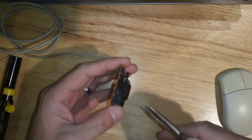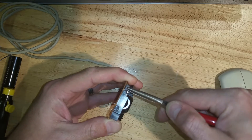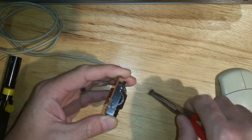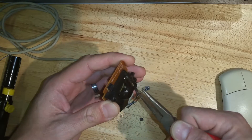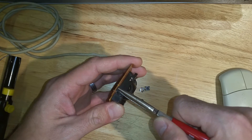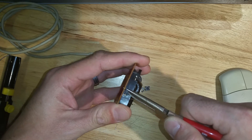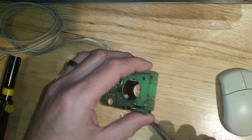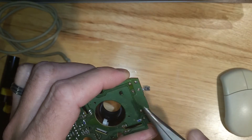Not using excessive force — just a gentle wiggle and pull that out. You don't want to give it too much force. There you go — that has just disintegrated, there's absolutely nothing left of it. You don't want to use excessive force; you're only just breaking off the small amounts of solder that are still holding the pins in. A quick inspection will show that those are okay.